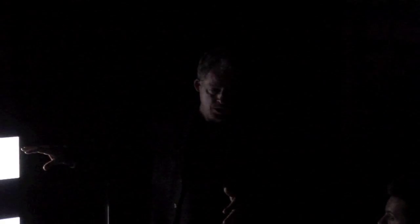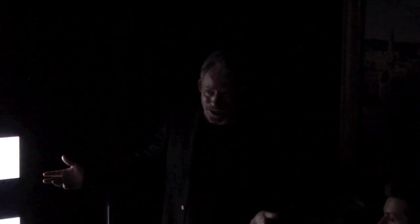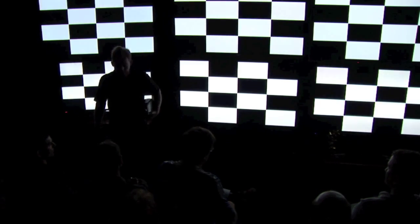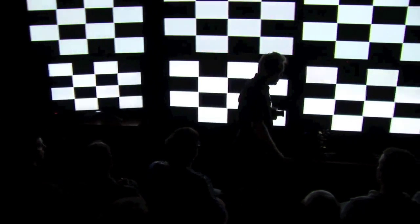So you can look whenever you want at the other contrast numbers. Also, the other thing to remember, whatever got the really high number from the on-screen method is probably going to win the off-screen method also. So let's go back to a black field on that, please, Ed. I want everybody to take a look at black. This is video black, zero IRE being fed out of a generator.